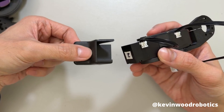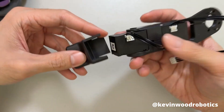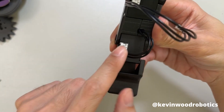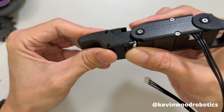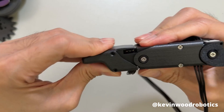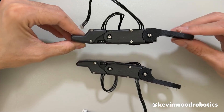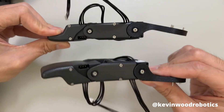Now go ahead and take the distal phalanx and slide it into the bottom actuator — this one is ID 2. You'll notice that one side is going to be a little bit higher. The higher side is the side that goes toward the cable. When you slide it in, you'll have to bend the cables down and then push it all the way through. The two holes should align right here. Put in two M2x12 screws. Once you have the other side assembled, it should be the mirror image of the one you just put together.